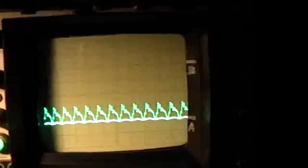Okay? Now I hope that this is enough to establish that if we use an external power supply as a bias source, current does flow. We are flowing current, DC current, with the oscillations rippling on top of that. Okay? Now, will it do the same thing if I use a function generator to provide a long DC pulse, like a 2-minute pulse? I think it will.